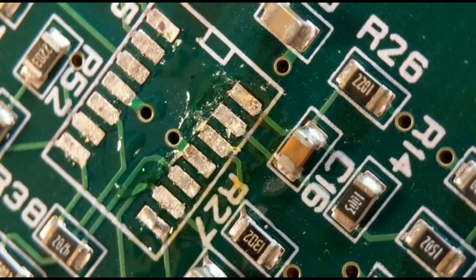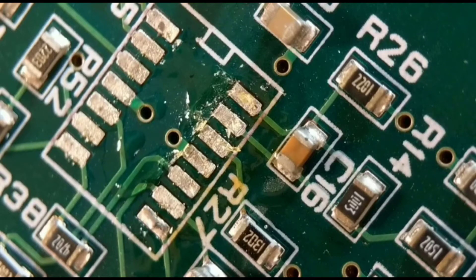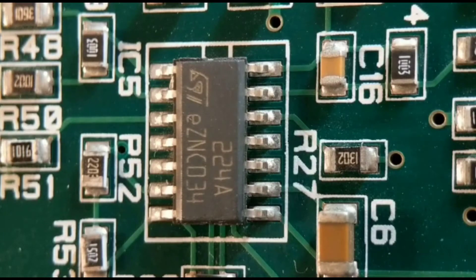I've already done the other side, so I only have one leg left to undo with the solder. Get tweezers on the body and it lifts straight up — there you go. Wick off the second side, and they're pretty clean with no damage. The chip is reusable once you straighten the legs. That's method three — a good method if you want to reuse a chip.